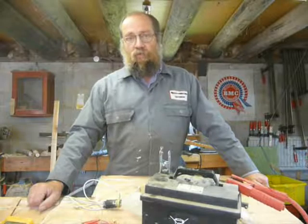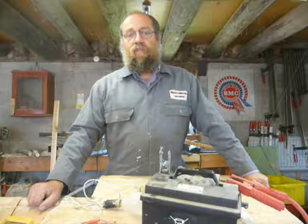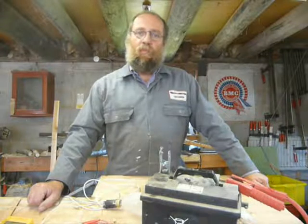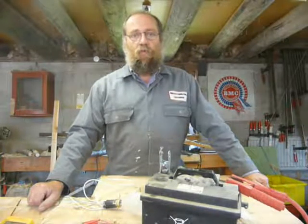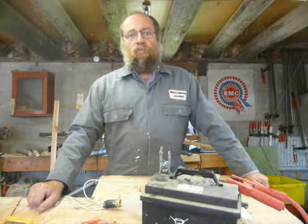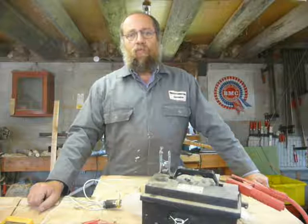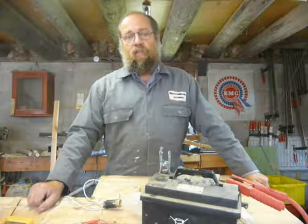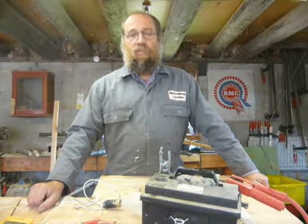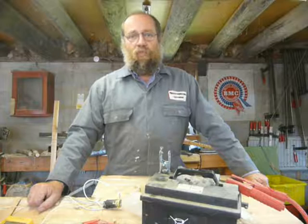This is a very simple low-tech way of doing it. You could use a regulator, but regulators get hot. Going from 48 volts DC — and that's a nominal voltage, so when the batteries are fully charged it's more like 56 volts — down to 13 volts, you're going to produce a lot of heat. It's also susceptible to spikes, over-voltage, and all sorts of things. And you really can't see whether it's working or not.